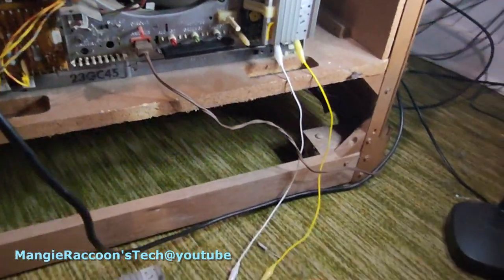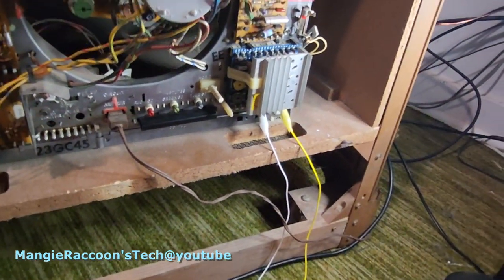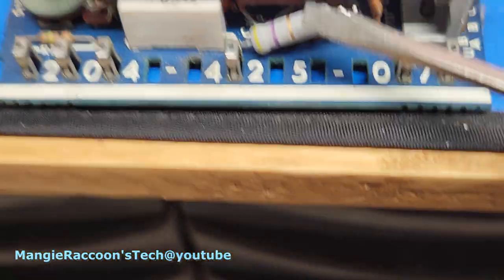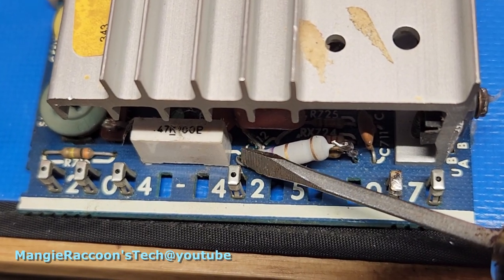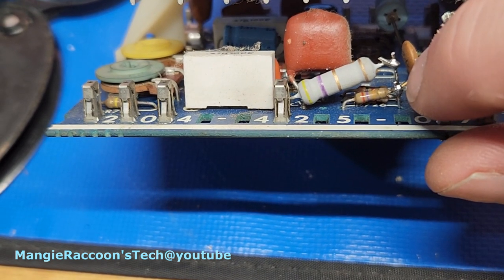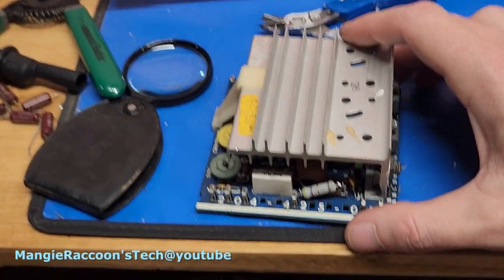Let's see if I can find a way to put this resistor on the board so the board can be removed and it doesn't look shoddy. Here's my modification: to the left there's an unused through-hole for ground, so I popped it in there. Then one of the first things in line for this pin was this resistor, so I lifted it, poured a little solder stake in, tied the resistor back into that, and added the new resistor. In theory that should work, and it's on the board and not tacked onto this pin.